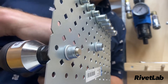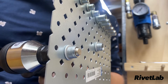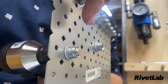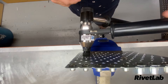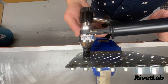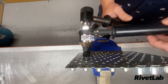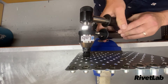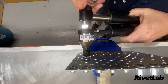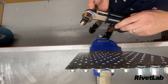You want to install to the point where you get just a nice flat shoulder. You don't need to over-install — if you keep cranking until you can't push any harder you risk stripping something out. At that point I'm satisfied I've got a nicely installed rivet nut. The tool is still in the workpiece — flick the ratchet switch to the opposite position, bring the top and bottom handles together gently, and then wind the mandrel out of the job. Installation complete.